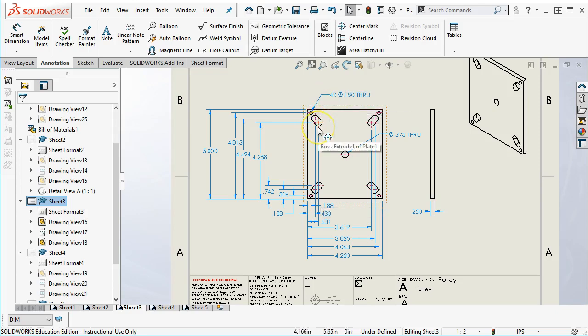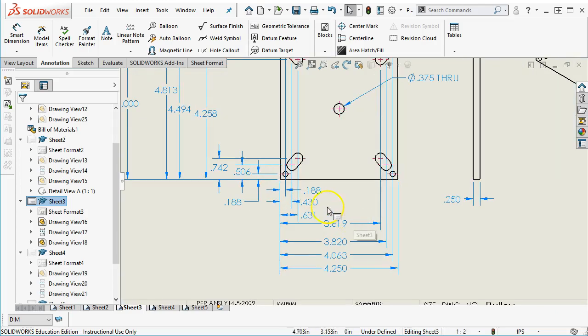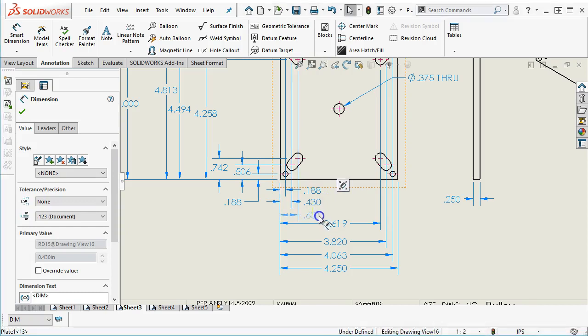All right. So as we're going through this level of the print, we're going to start looking at what happens when we get to our maximum material conditions, our least material conditions, and if we have established these as datum A on the flatness, and then the datums B and C on the perpendicular faces, how is that going to relate to our positional tolerance on the 4 holes? Right. I think the machine can get there, but have I made these too tight as I'm going through that process? All right.